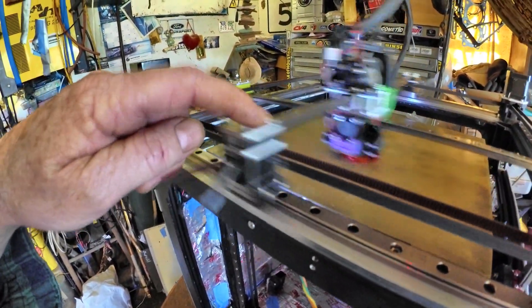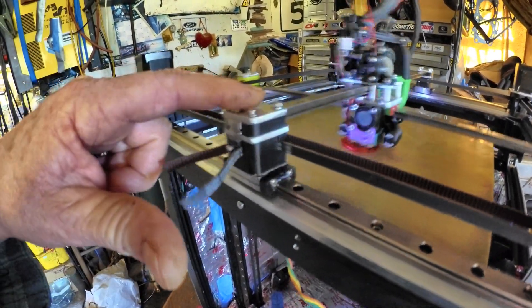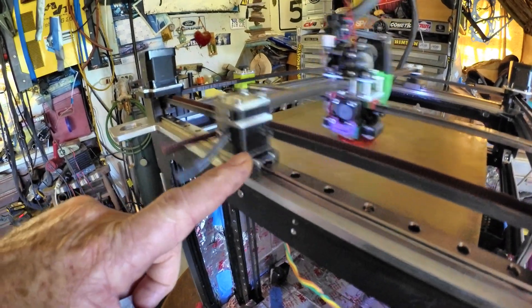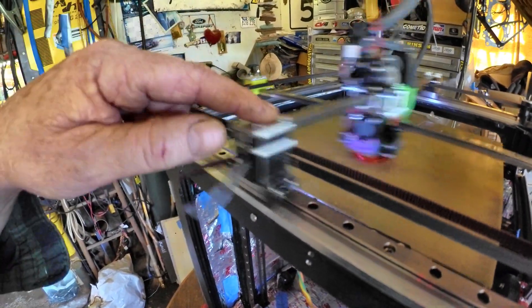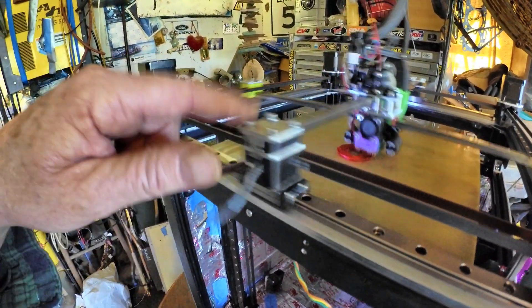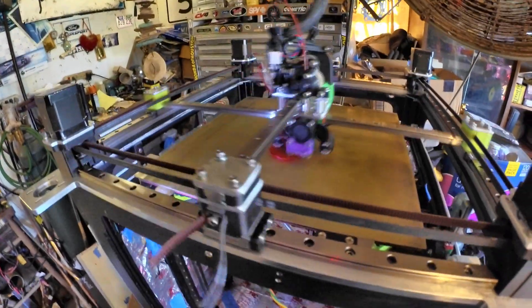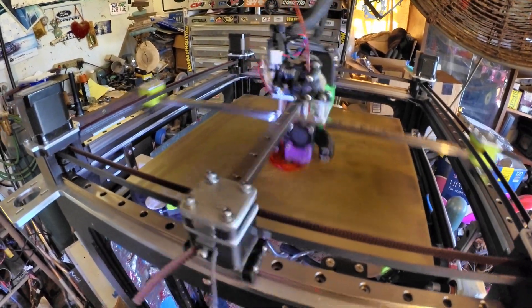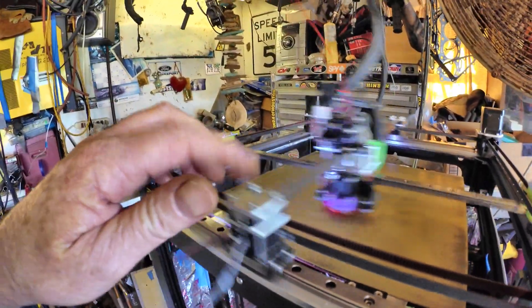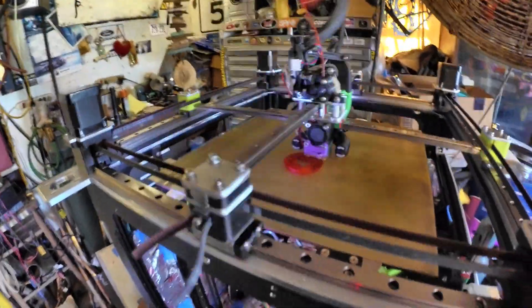One of the problems I had was this carriage block here. The rail is sandwiched between this aluminum plate, another aluminum plate, and then inside this lower printed part are four aluminum standoffs, so that when these bolts are tightened the plastic doesn't deform and cause the rail to twist. I had problems where I would take it apart, put it back together, and the rails would bind — because this was inconsistent when torquing these down on what it would do to this wide cross rail.